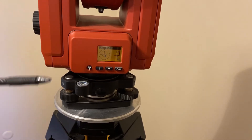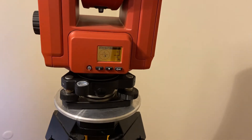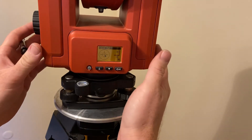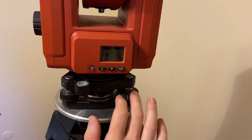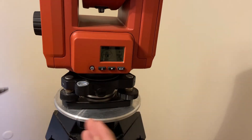Now we're at the final phase of leveling. We've gone ahead and turned our tool on and now we're on the level vial screen, which usually pops up immediately. What we want to do is make sure that black dot is inside the smaller inner circle and over those crosshairs depending on accuracy. A tip or trick is to make sure the head unit is not sideways — you want the face of this unit in line with the two leveling knobs so everything is in a nice straight line. There are many ways to do this but this is the easiest I've found.